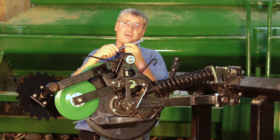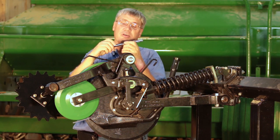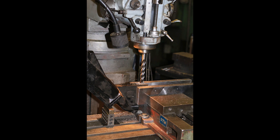Here's some more information on drilling out extended wear John Deere seed boots with the solid carbide drill bit. When drilling out extended wear seed boots it's critical that you hold the seed boot tight. In this example, the grower built a little fixture and presses the seed boot over a one-inch bar stock at the bottom. That boot is held securely with a 3/8 ball in the bottom, and a piece of all-thread at the top holds it in place.